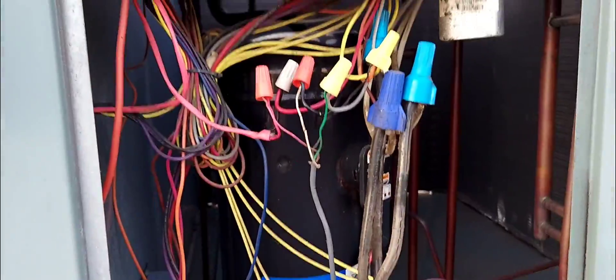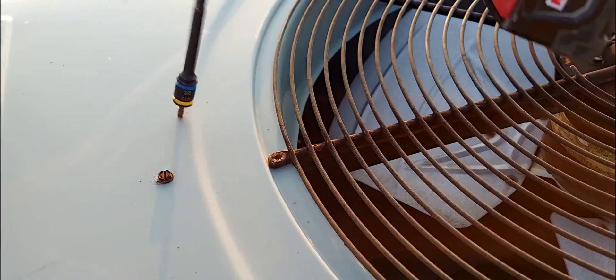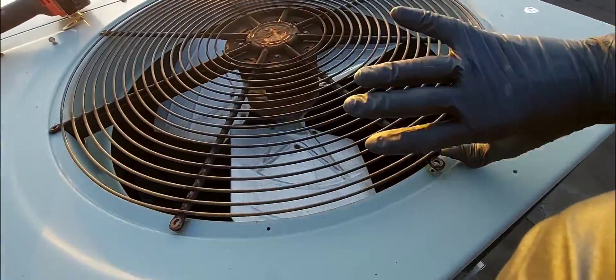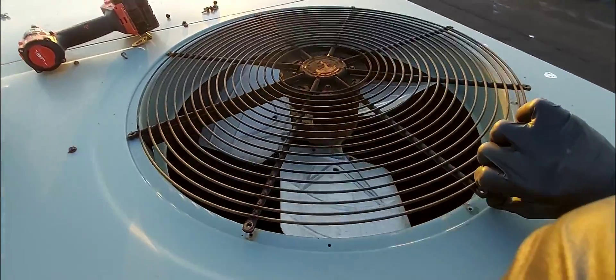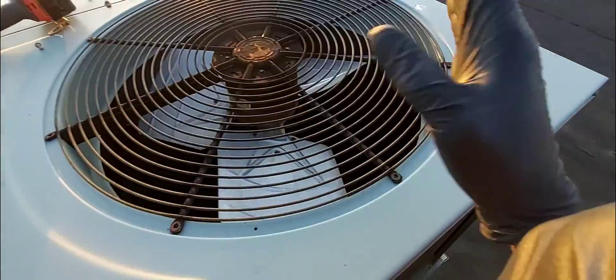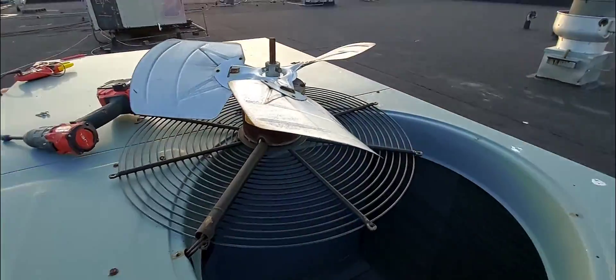Apparently cleaning from the inside panel won't work, so we're going to have to go from the top. I've already started removing the 5/16 screws — I'm removing the motor. I think I've got them all, and this thing lifts up. Make sure you're careful not to bend the blade in the process; once a blade is out of alignment it's done — you'd have to replace it, you can never re-straighten it. The motor is out, the sun is setting, and the coil is exposed. You have access to all of it from the inside.